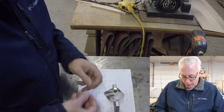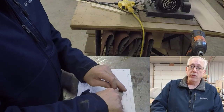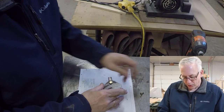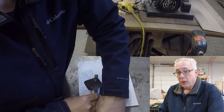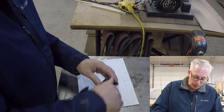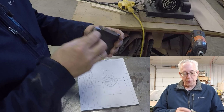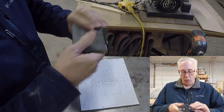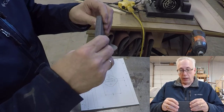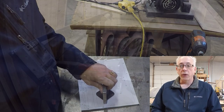Once it's on the flanging block, then we can take it to the arbor press and we can actually bend it in a very controlled way so that we've got a good bend going both directions. So here we go. I drill the holes just so that they just fit, so we wanted to make sure that we've got a good tolerance in there. You don't want that bracket wiggling around when it's mounted onto the fin. So there you can see, we've got this mounted nice and tight on here, and then we turn it over. I'll show you the block in a second here, but I'll move the cameras over and show you how we actually bend it down and get the shape that we're looking for.